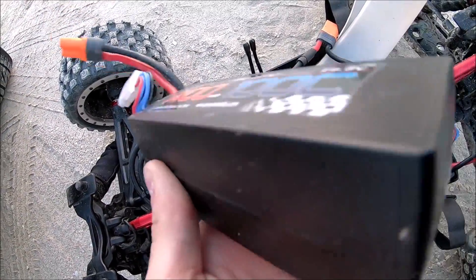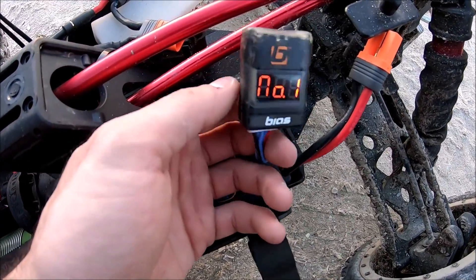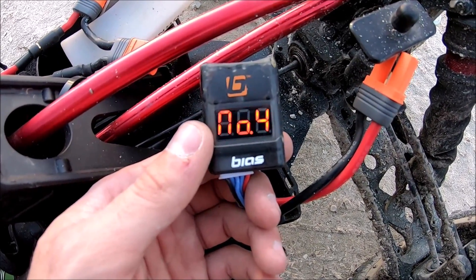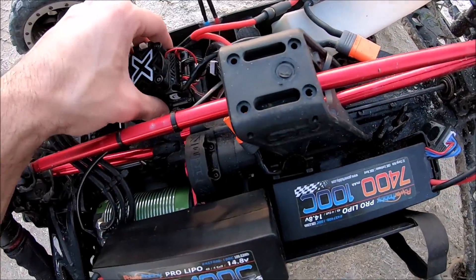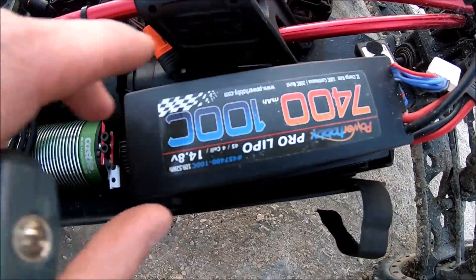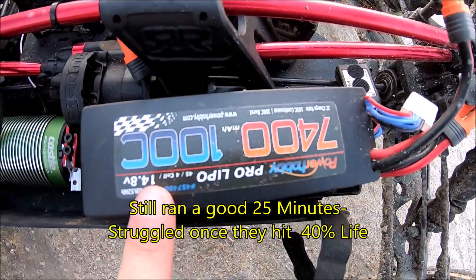You can see it's a little bit puffed out from the inside. The cells are just experiencing a lot of load. Normally voltage cutoff is around 3.2 to 3.1 volts, so that's probably why the ESC was cutting off — there's too much load on the batteries and the voltage is dropping way too much. These batteries are awesome up until this caliber of a setup, so I really need to invest in better batteries.